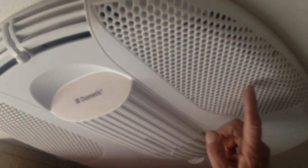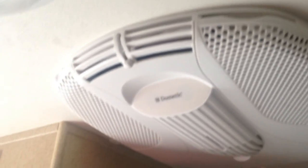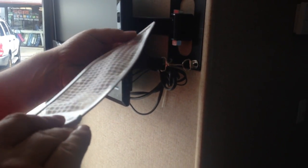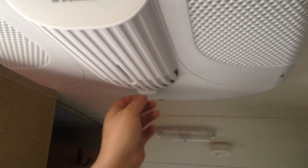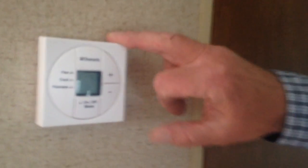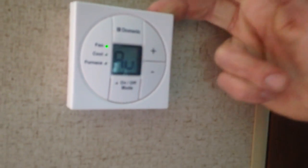There's air conditioning with filter panels inside the return — it feels like vinyl or nylon so you can probably wash it a few times before replacing it. There are airflow adjustments all over. The thermostat controls everything — it's best to leave the fan on automatic so you don't have unnecessary noise. One click is cool, one more is heat, one more is off. The furnace is mounted under the bed.